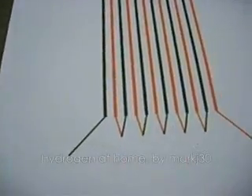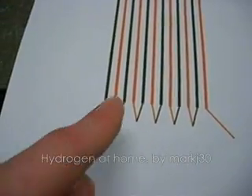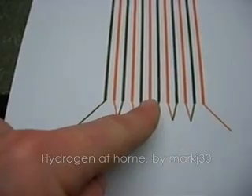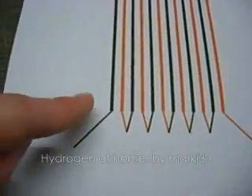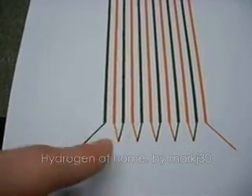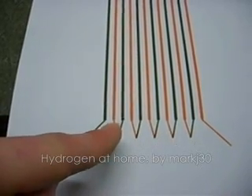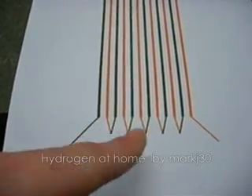This is the circuit diagram for this. It works in a similar fashion to neutral plates, whereby each of these main gaps here is dropping the voltage down, so I'm getting 2.2 to 2.3 volts between these main gaps. Basically the negative is coming into this plate and these top ends aren't connected to anything — jumping across and creating hydrogen with 2.3 volts between that gap. Then these two are directly linked together with the cable, so there's no hydrogen being generated between that gap. There's only a slight bit of voltage there, maybe 0.03 of a volt, so I might be losing a little bit of efficiency because of that. And then it just repeats across, as you can see.